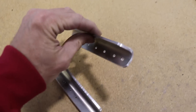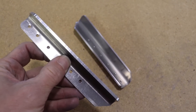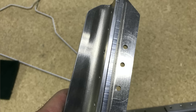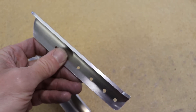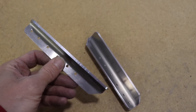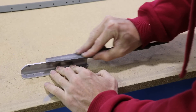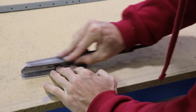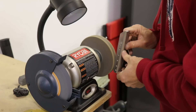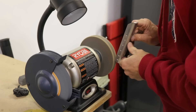I wanted to show you these two big thick brackets for the horizontal stabilizer. When they come from the factory you can see the rough edge the cutting machine leaves on them. I'll put a picture on the screen so you can see how perfectly smooth that edge is after polishing, and I really think you should smooth these out. There are two different ways to do that. The first way is to use a file, especially for the deep grooves — a file works really nicely to level it off. You can completely finish it with a file, or get it mostly good with a file and then move over to a scotch-brite wheel. You can use a powered scotch-brite wheel to perfectly smooth the edges. This wheel works really really nice.